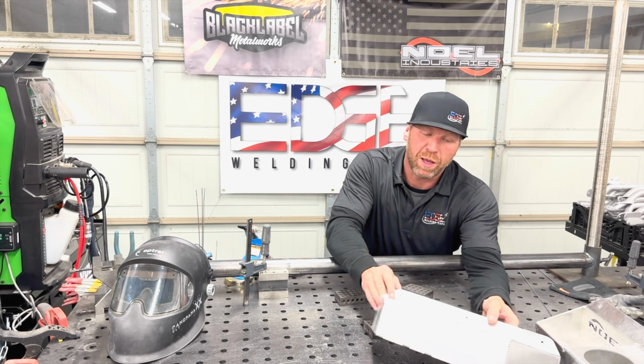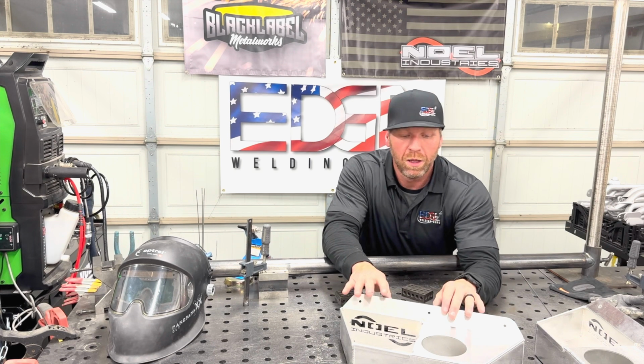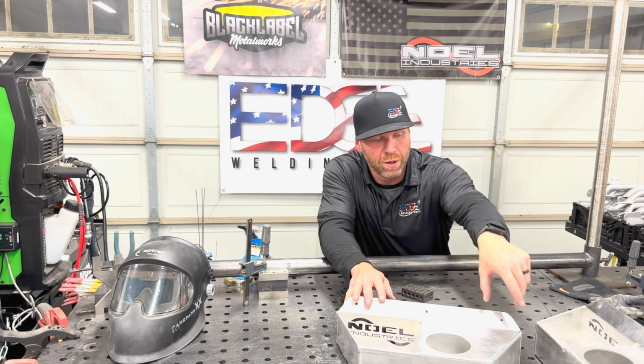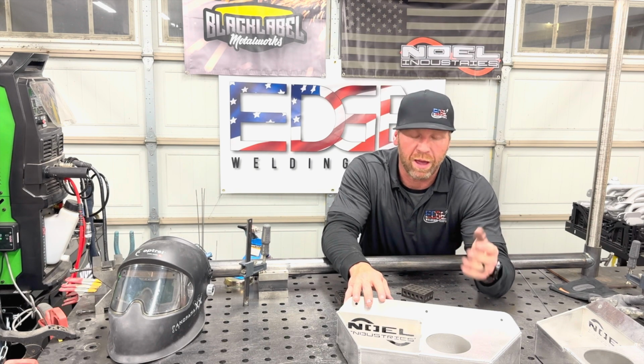Now, on to the last parts of this. I'm gonna have to change my amperage, I'm gonna have to change my style. We're still not wanting to go full penetration. I can't pierce through the backside, but I've got to protect this right here. I can't have this separating, breaking this tack or anything like that. So I've got like a 2-inch weld through here, a 2-inch weld through here, and it just looks cool when you have those big dimes, those big fat welds.